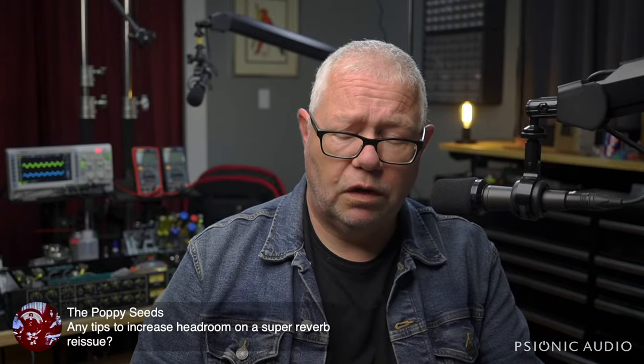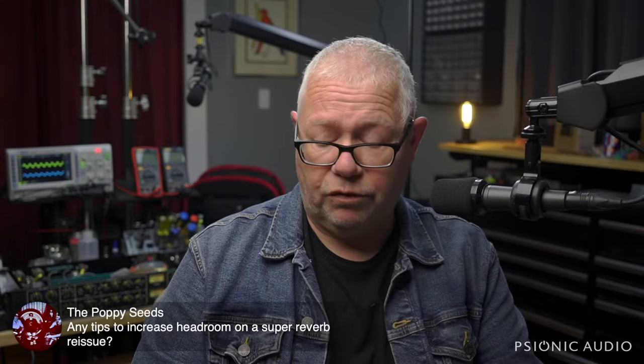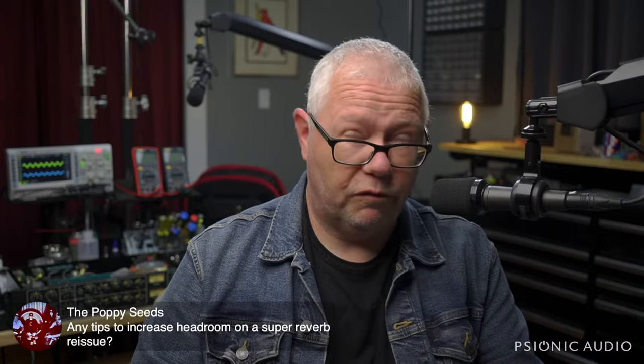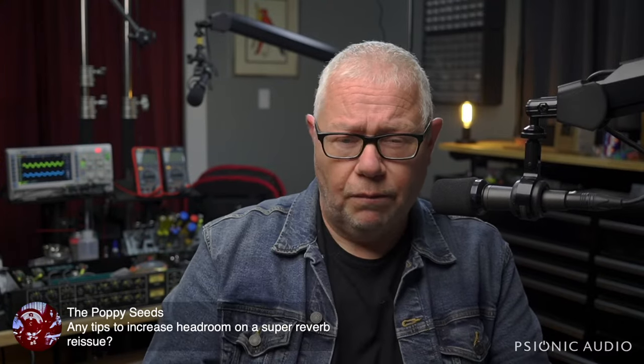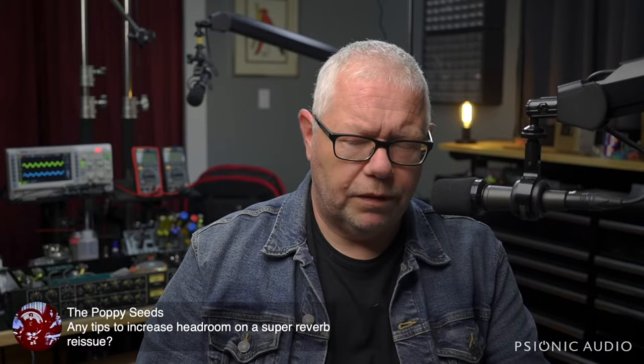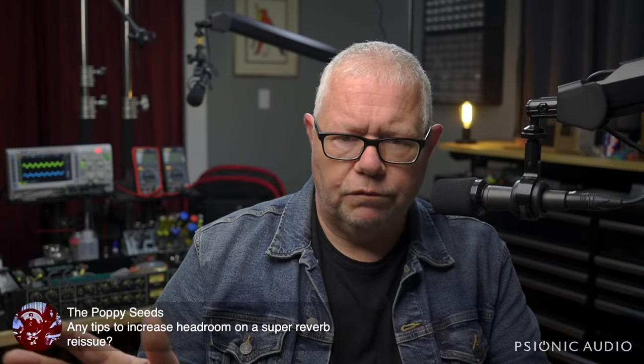No, that's pretty much all you can do. You can play around with V1 and V2 being 5751s or 12AY7s if you really want a lower gain. And you can also play around with V3 if you wish. I'm sorry, V4, the reverb recovery stage. Beyond that, if it's not enough headroom for you, and there's also the number two input jack, something's wrong with your amp because those have a lot of headroom. It depends on what you're looking for. You can't make a Super Reverb sound like a Music Man HD 150 or whatever, or 130, whatever it was called, the big solid state headroom monsters.